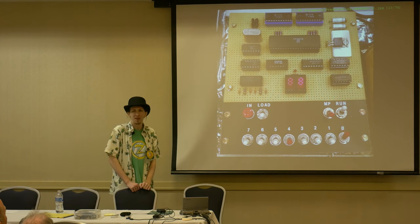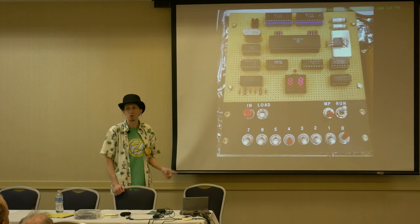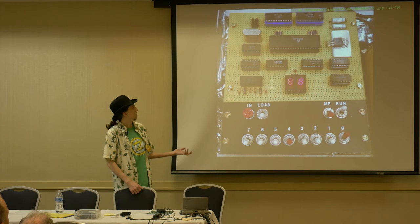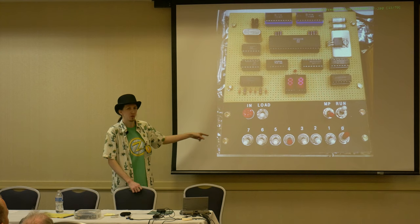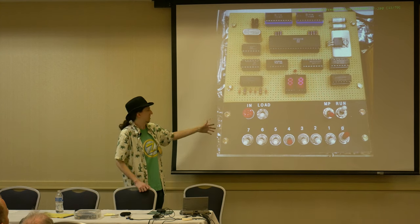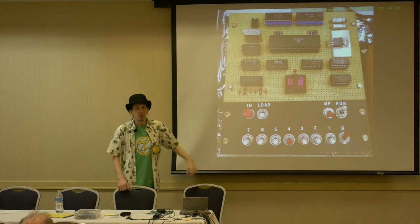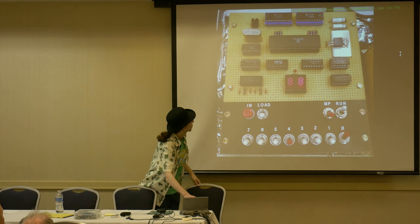For the 1802 fans, we've got the ELF. With a copy of August 1976 Popular Electronics, you could build a cheap machine — around $80 to $99 threshold. It's got a very simple front panel DMA interface with a tiny amount of switches, but you're still able to do a lot. It's just you, the processor, not too much else.